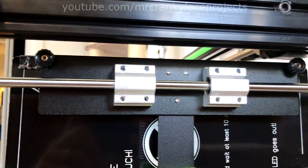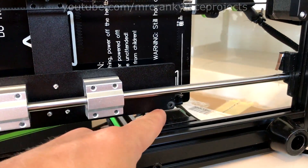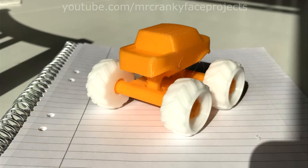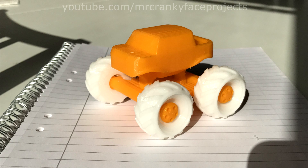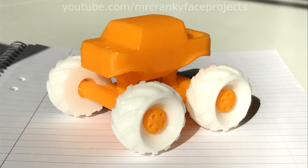While changing to a glass plate, I also started getting annoyed by the over-constrained 4-point leveling system. So I simply removed one screw and made it into a 3-point leveling system. Initially I worried about whether it would be strong enough, but judging from the print quality, it definitely works and is much faster to level. In the long run, I will probably rebuild the underlying plates to properly support it at 3 points.